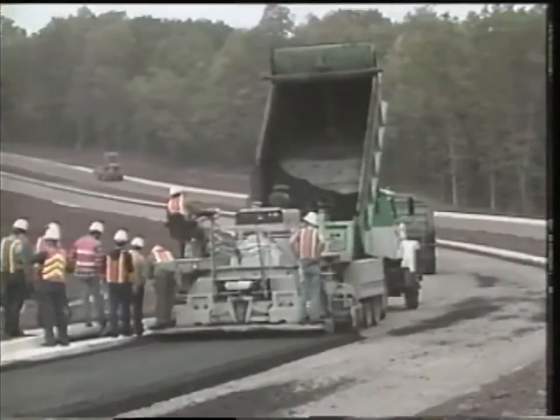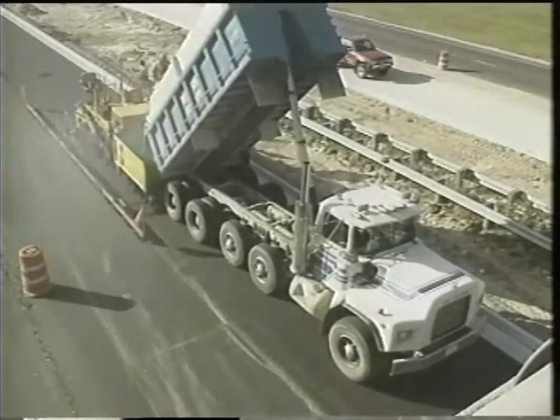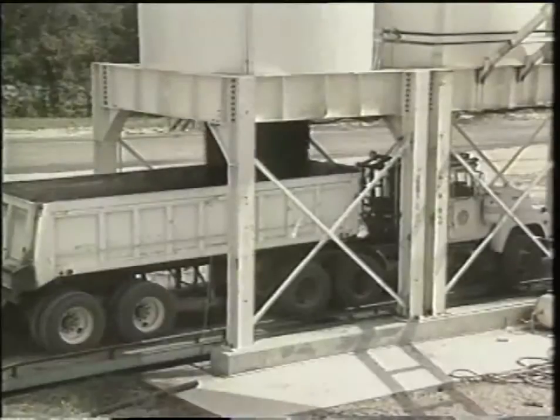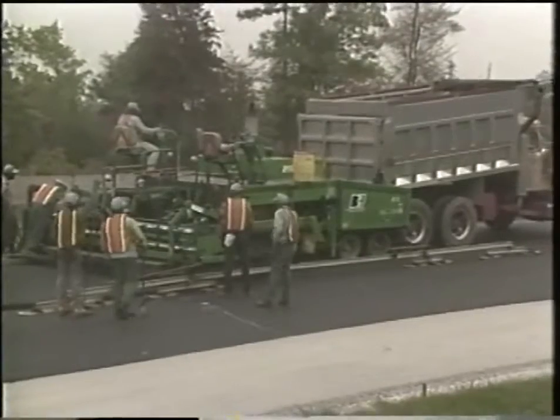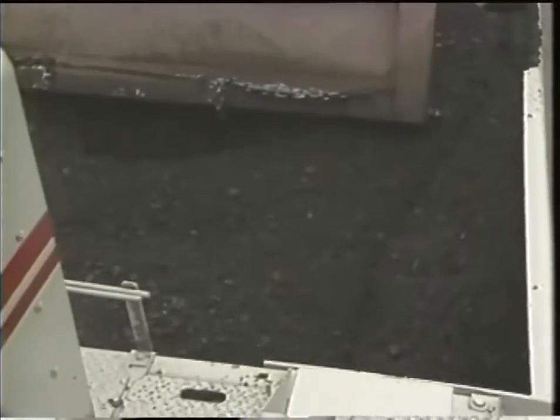While city, county, and state employees perform most pavement maintenance tasks, overlays are generally placed by commercial contractors who specialize in overlaying. During placement, weather becomes important. Hot weather is best because it gives the crew more time to place the overlay and compact it to the proper density before the hot mix cools down, and dry conditions help assure that the overlay will form a bond with the asphalt layer underneath. First, a tack coat of liquid asphalt is applied so the overlay will adhere properly. Timing is essential for the trucks delivering the hot mix — any delay causes a seam in the overlay mat, but trucks must also be spaced far enough apart so the hot mix doesn't cool off sitting in the trucks.